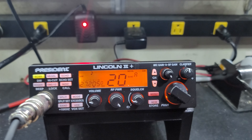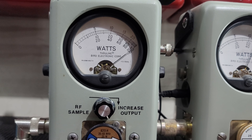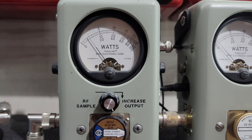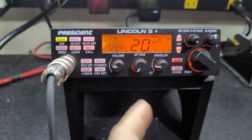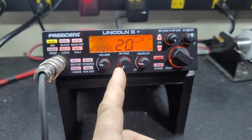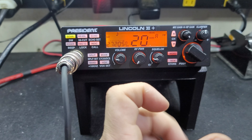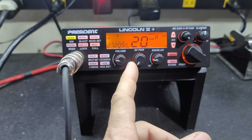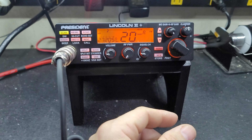Let's go over here and go to FM. You said you like to talk FM — 25 watt scale, you'll do 25 watts all the way up. But you mentioned about running your amplifier with it, so we set it so it would turn down to around 2 watts. So if you're going to run your amplifier, you're going to run this all the way down. Also keep in mind, everybody watching on FM — you have no amplitude modulation, aka AM, so there is no forward swing. You're going to want to run your amps conservatively; they're going to put a lot more heat on FM. Watch your key-down time.